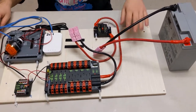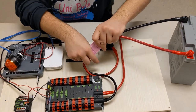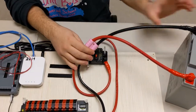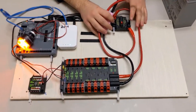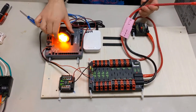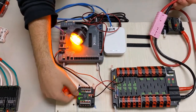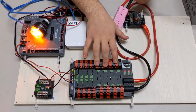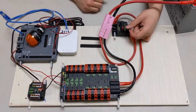Your battery does require a little setup. Again, that will be in the description. You connect it, and after that, we turn on the robot signal light. Everything should light up. The robot signal light should light up, the modem should light up, the roboRIO lights up, our VRM lights up, and our power distribution board lights up. So everything's working fine. To turn it off, we just press this red button.